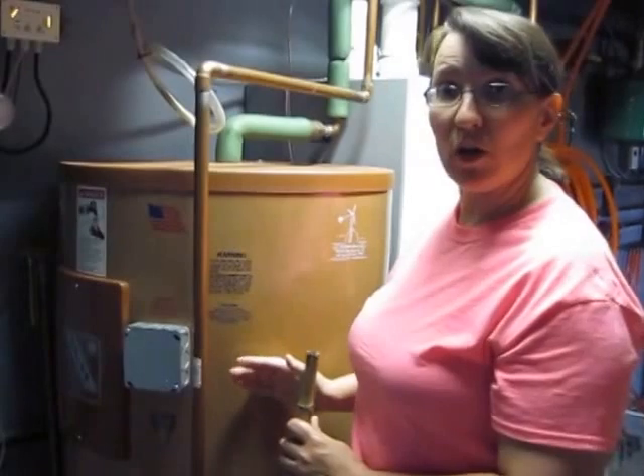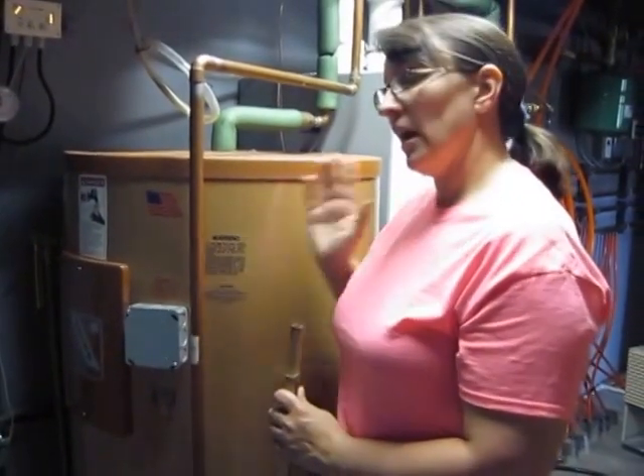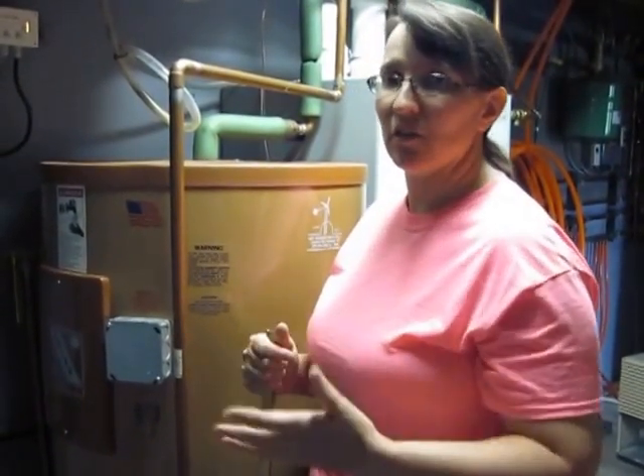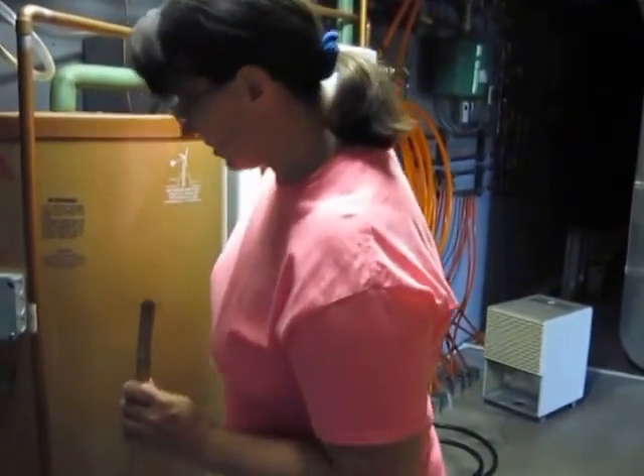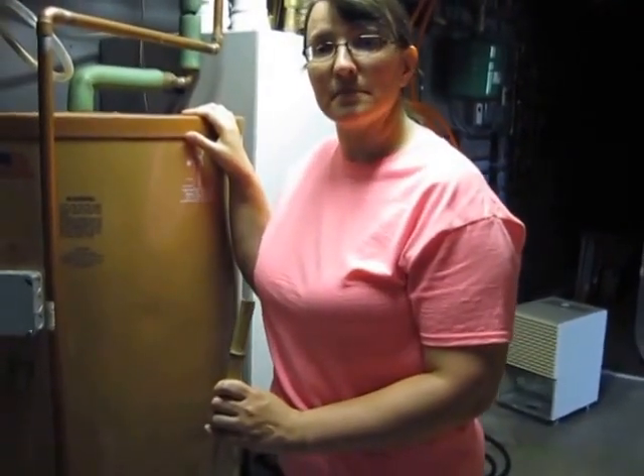That way you only run the pump when you're actually gaining energy from the solar panels. This is frost protected because there's antifreeze in the loop from the solar system. And there's a double wall heat exchanger between the solar fluid and the potable water for the house, so you have a very minimal risk of any contamination between the two. Because the heat exchanger is double wall, it makes it very safe. And if there ever was a leak, the heat exchange fluid — the antifreeze — is a propylene glycol mix, which is technically safe to consume in small amounts. That is the other half of our solar water heating system. Thanks for listening!